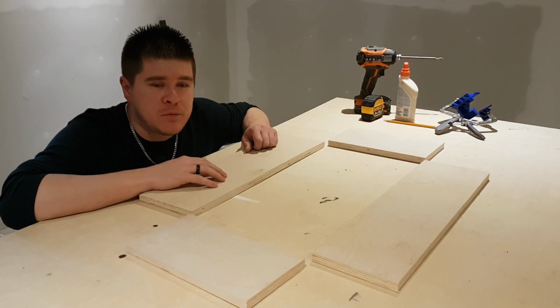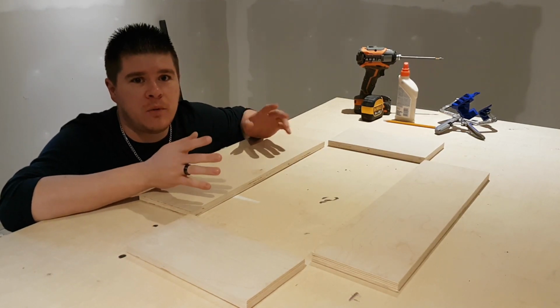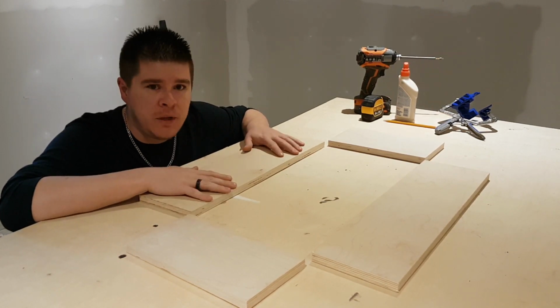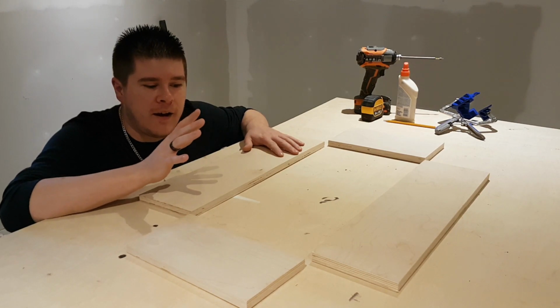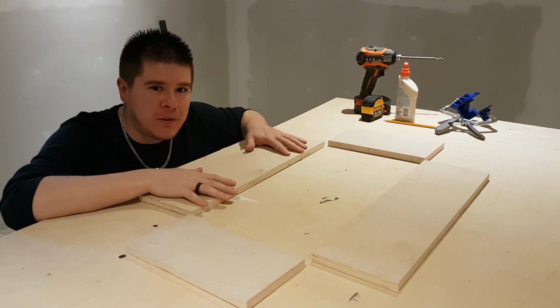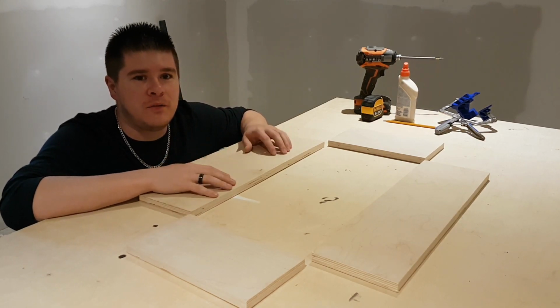Alright guys, now I just attached my drawer slides. They're a full extension drawer slide. You can use whatever you want. I'll have a link to those down in the description box below. Now you've already seen me cut these pieces as well. Now I may have sized my drawer opening there based on some scrap plywood that I had laying around, but you can really make that whatever size you want and then cut it to fit.